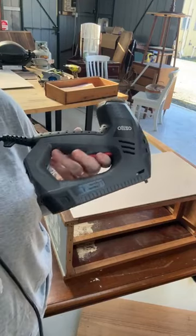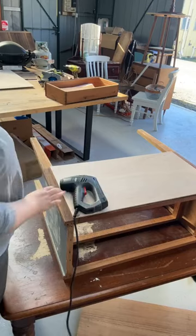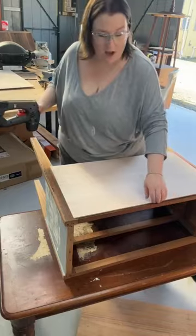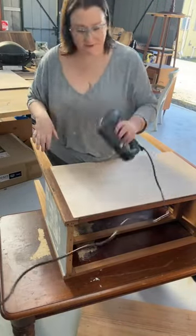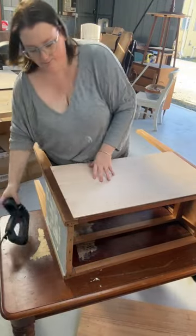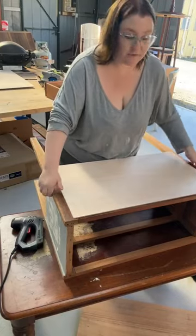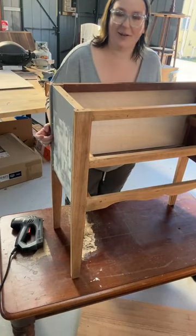As great as that is, this small one weighs maybe 500 to 800 grams - no more than a block of butter - and it's got quite a bit of power behind it too. It does a really, really good job and you can use nails in it as well - you can buy the specific nails. Our back's on. I like to go along and double check - I like to have a nail or staple every ten-ish centimetres. That way it just stops it from buckling off later on.